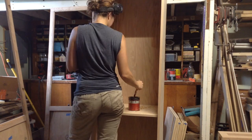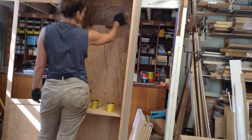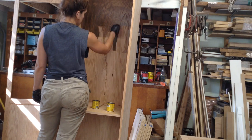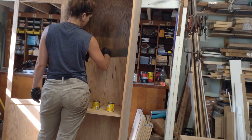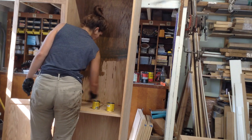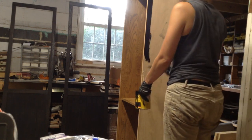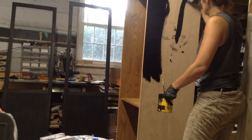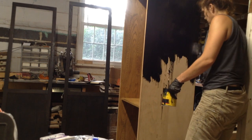For these, they're getting stained and I'm going to pre-stain them. Oak usually doesn't need pre-stain — it takes stain really well — but just for continuity of the finish I do put it on. The quality of this plywood has changed; you can really see the demarcations between certain panels, so the pre-stain does help with that. The inside of these is getting a brown driftwood color and the outside is getting black. I actually really liked this true black stain — I hadn't used it before. It's transparent enough that you still see all the grain of the oak, and I do like this two-tone technique. It turned out pretty nice in the end.